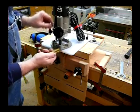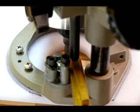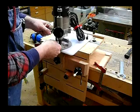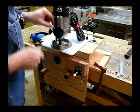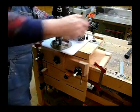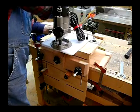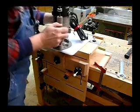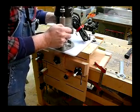I have a half-inch and a quarter-inch brass bar. Prop it down and tighten it. Now I want to set this piece in the back to keep the router from tipping out. Test our cut — nice and smooth, it's not going to tip out. Tighten it down.